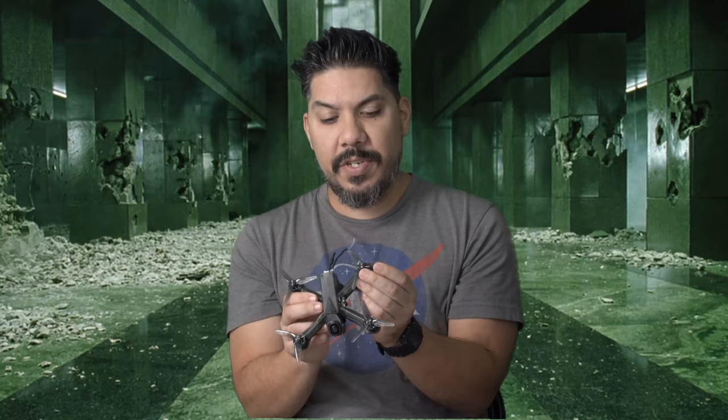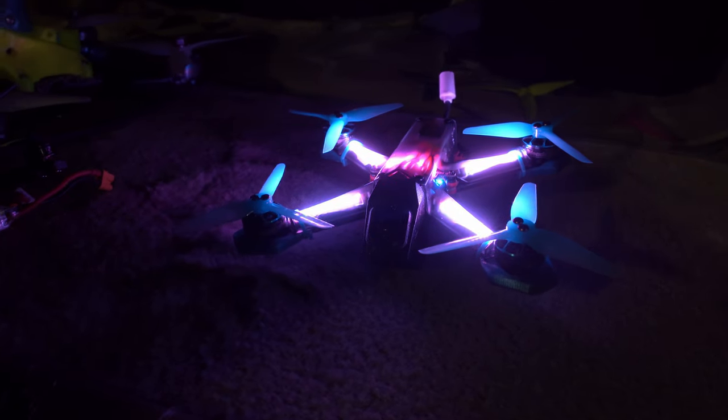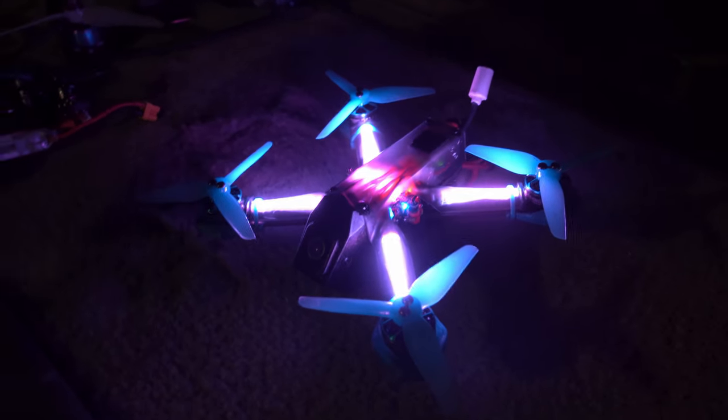This is a 1404, 4533 KV motor, like a tiny version of the big heads-up motor on this prototype Switchback HD. This isn't about giving you the fastest 3-inch experience possible — it's about getting a 3-inch flight experience that approximates a much bigger racing quad so you can train those lines. It also gives you the full LED experience like you get on the show. Sometimes with things this small it's kind of hard to see, but with those LEDs on there, man, it's just a really cool scene.